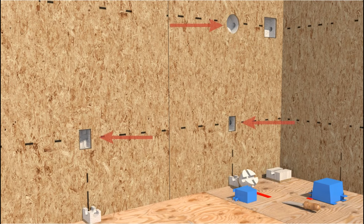Make sure that the drilled access holes are clean and completely clear of debris. Remove any debris from the electrical chase holes in the SIPs — this will make running electrical wire easier. It's recommended that you retain cut-out pieces of the receptacle and switch boxes in case you need to make location changes later. The cut-out pieces can be used to plug any unused switch, receptacle, or fixture box openings.